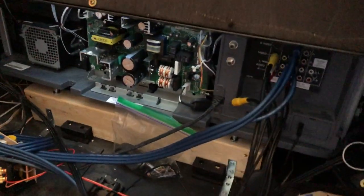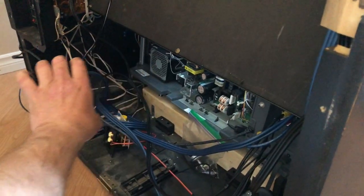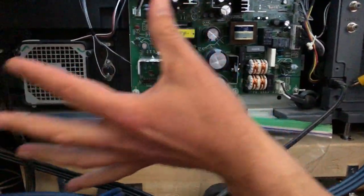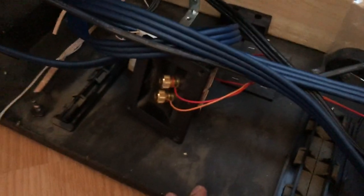Take a look at the back cover — all of this used to be occupied by a large CRT gun assembly, with lenses and another mirror. But here is the Sony chassis now. I'm not done yet — I've got to pipe this fan out to the rear and bring the rear panel controls out and make it all fit and finished. Right now I've built a frame out of 2x4s attached to the bottom, with adjustable bolts so I can set the exact geometry and height. I've also got to mount these crossovers — they drive the woofers and tweeters — I've got two of them.